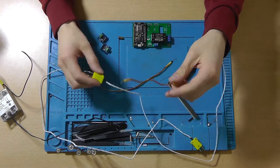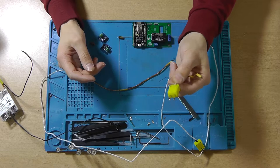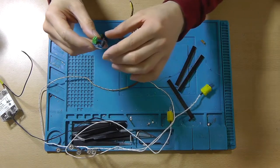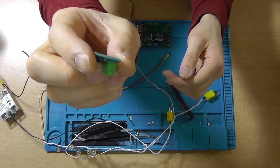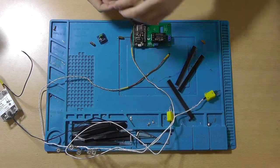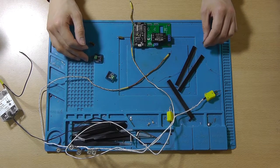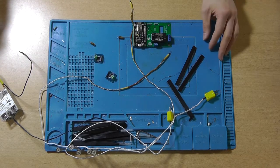Then you're going to need two K-type thermocouples, and you'll need to connect these little funky pins to the end to allow them to be screwed into the MAX6675 thermocouple board. This is a K-type thermocouple controlled with a read-only SPI interface. You also need two of them. The two make for an upper and lower temperature, and you could compensate that because there are two heating elements in your kitchen tabletop oven.